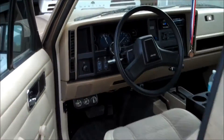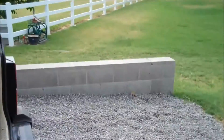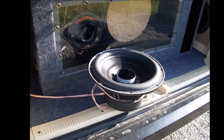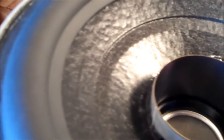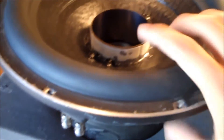Now for another 60 hertz test tone on the other coil. And again it works — pick it up, no noise. The speaker has gotten time to set up now. I've tested it and made sure both coils are working. That's an important step because you don't want to seal this up and not have stuff working. I've made sure these are all covered up with adhesives. Everything's working perfectly, so it's time to put the dust cap on and complete this woofer build.